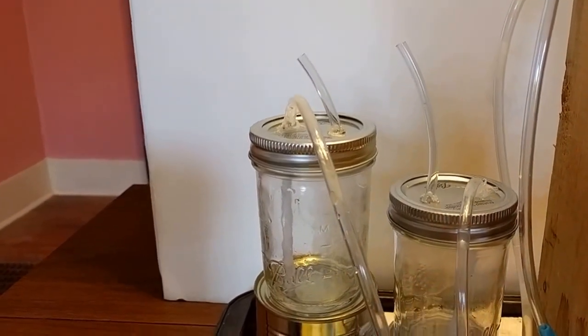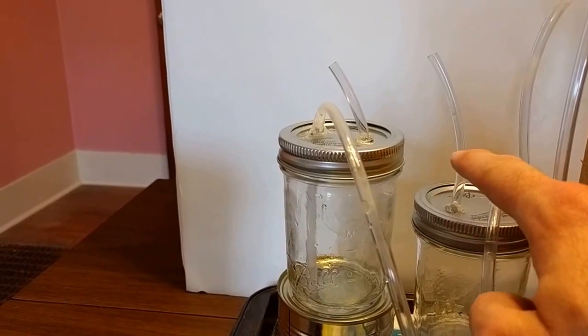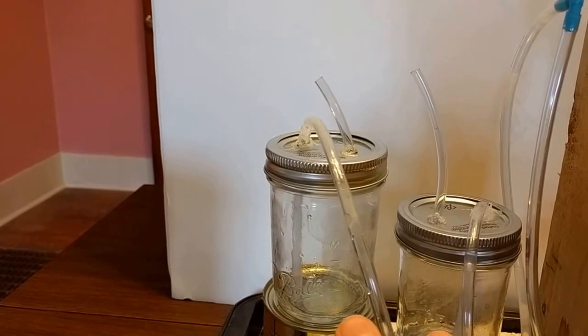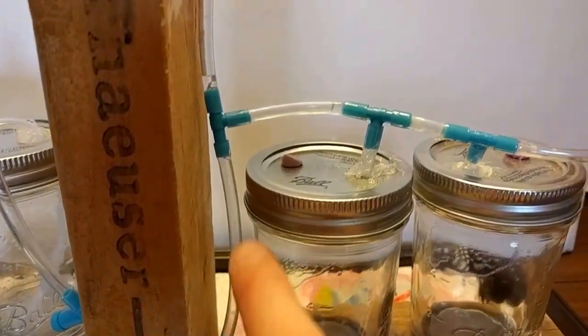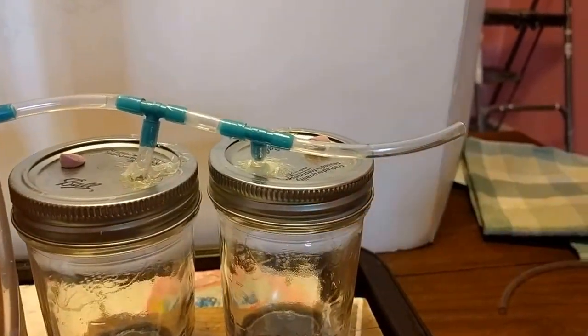In the lower barrel it will fill first. When the lower barrel is full, water will go up the snorkel and fill the second barrel, and no water will overflow - I didn't include an overflow in this design. Over on the simpler side, it's much simpler because the water just goes down the trap and then into both barrels and overflows simultaneously.